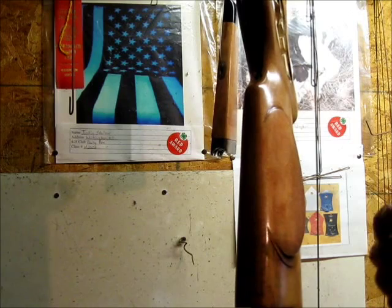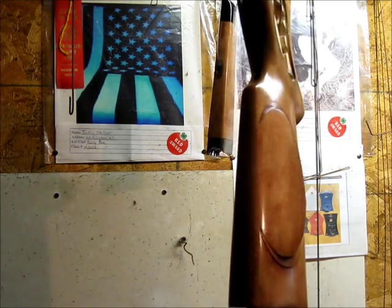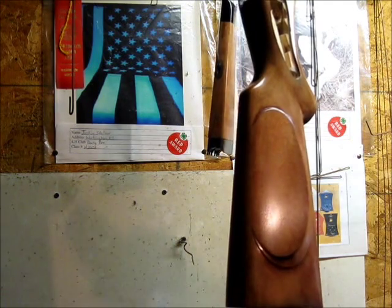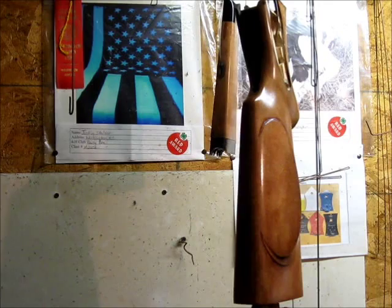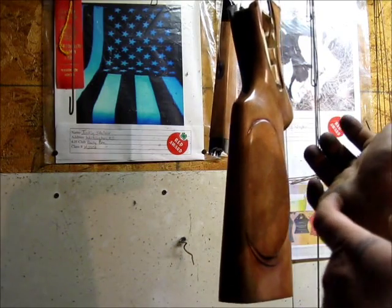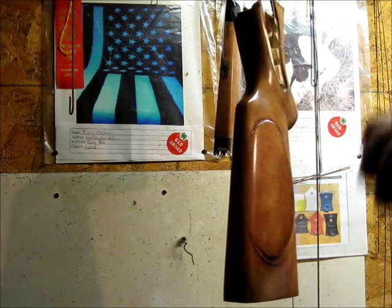and the coats after that are done just with a little dab of it on a finger, and you just rub that in as far as you can get it to thin it down, and then you take another little drop. It just takes a drop or two, and you just keep rubbing it out until it's completely coated, but it's hand rubbed. If it's a little cool or a little cold, instead of using your fingertips, you can use the palm of your hand, the butt of your hand, and rub it in with that. It'll generate a little more heat, a little more friction.